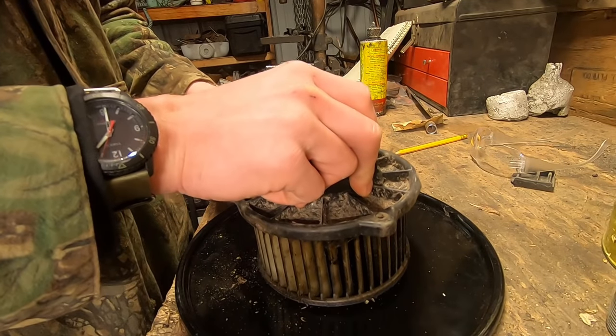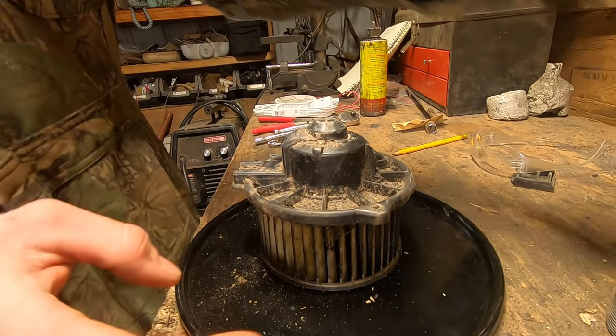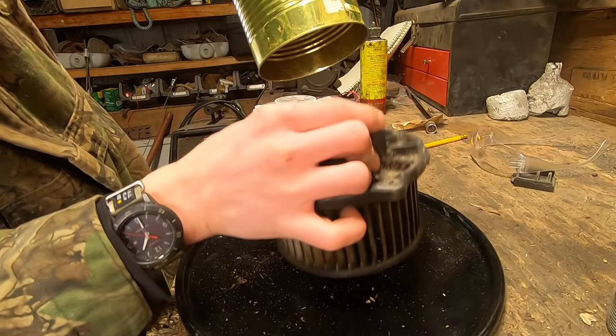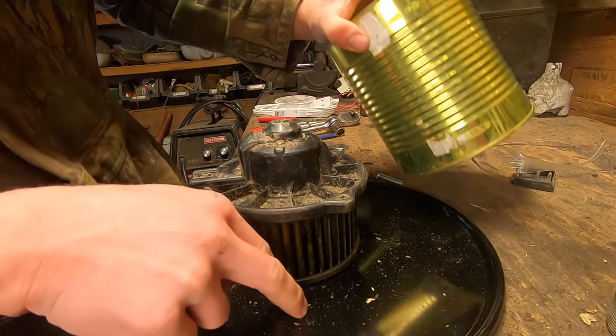This is going to sit right in the center of the top. I'm going to cut a hole just big enough so it can suck air in. And then on the side of this can, which I'll cut down just deep enough for the top of this fan not to hit the top of the bucket. And then out of the side, I'll use another tin can. I'll solder this all together, and that includes soldering the can to the top of the lid.